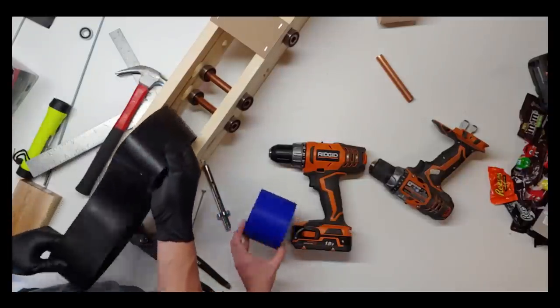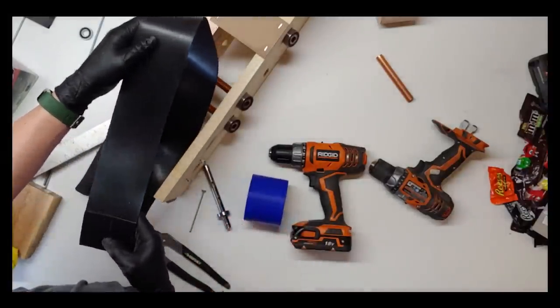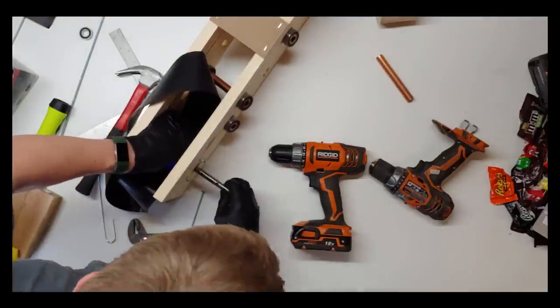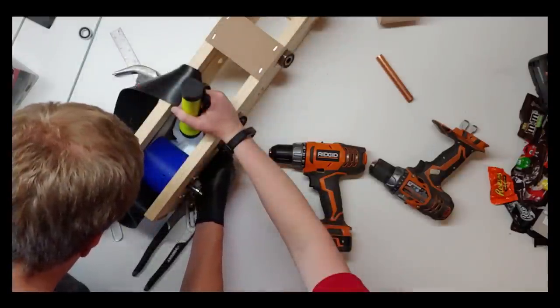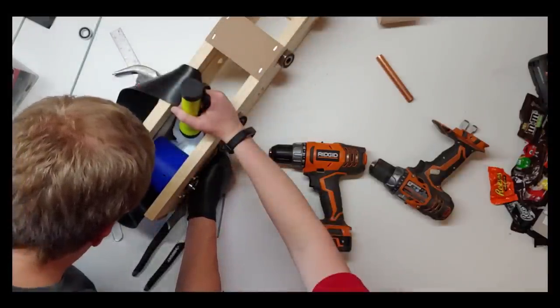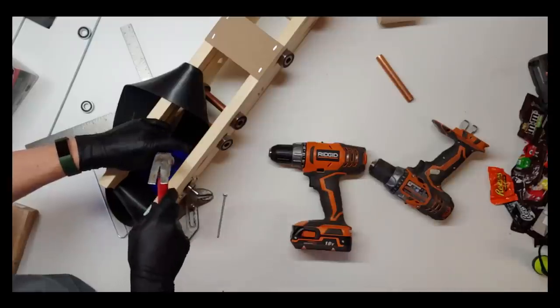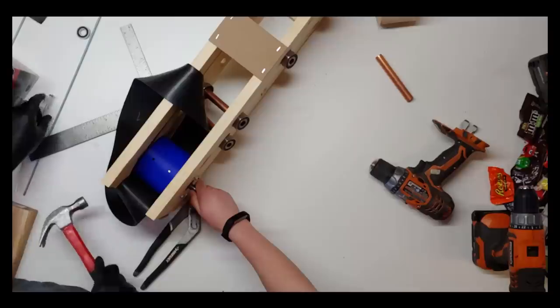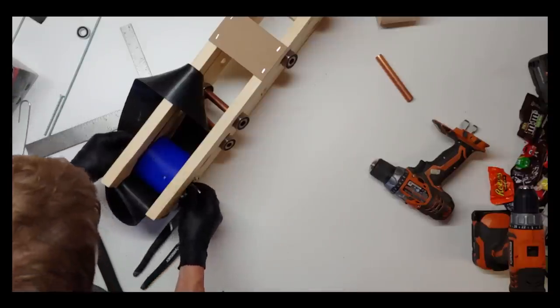We replaced the wooden wheel with one we printed on our 3D printer and designed it so that we could attach it to a drive shaft made of metal instead of wood. We hoped this would help us hold a tighter cylindricity and help get rid of some of the wandering we had with our belt. You may be wondering what cylindricity is. Well, cylindricity relates to tolerances. You may have noticed that nothing is perfectly square, flat, or rounded. There's always a little bit of variation.